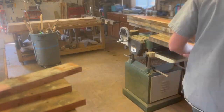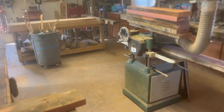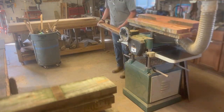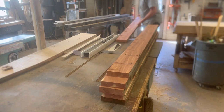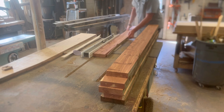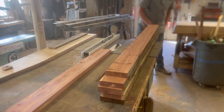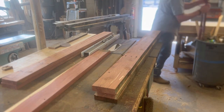In this project it's really important that the thickness of the legs and the thickness of the top are the same. The shelf can be a different thickness, and it actually is. After I got everything almost flat, I had a couple of boards that still needed to go through the planer a couple more times. I saved those as my shelf boards, kept track of them separately, and ran those through the planer one or two more passes. So that shelf is actually slightly thinner than the rest of the project — but as long as your legs and your top are the same thickness, that shelf can be any thickness you end up with.